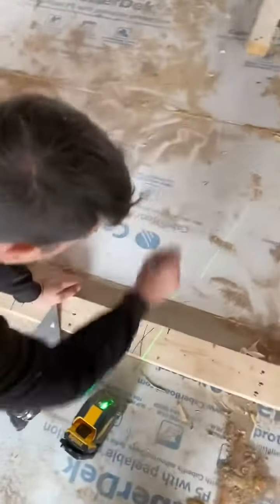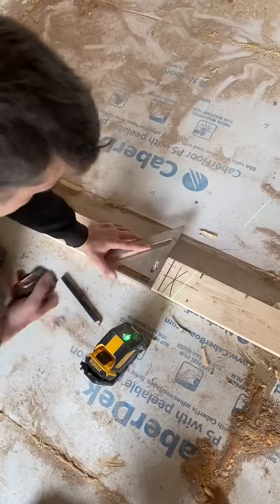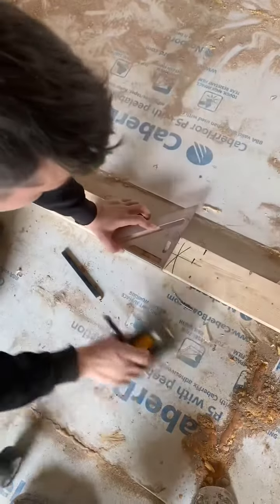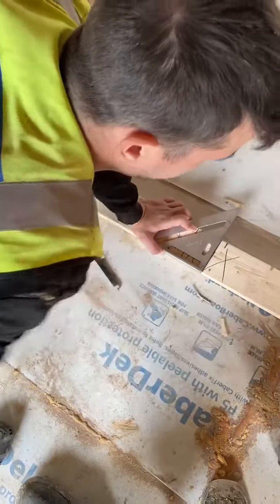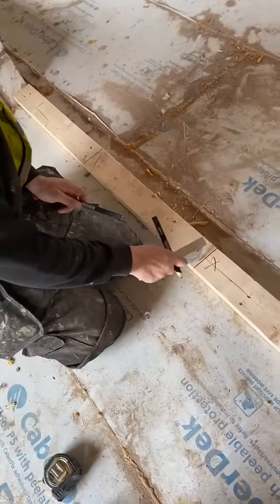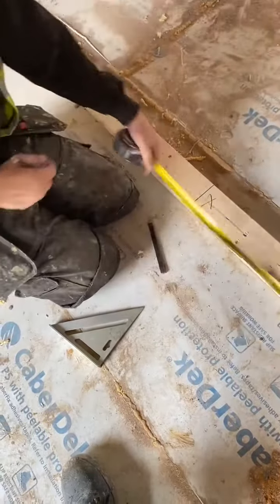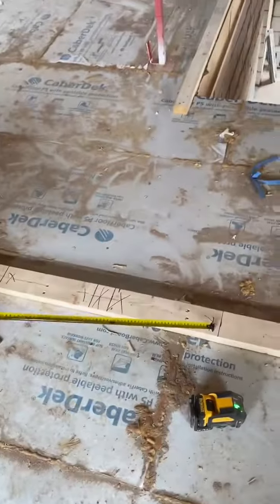That intersecting wall there means you'll have a stud here that will be open for that wall, with a spacer in between. Then it comes to about 63mm — that's from a CLS — and there will be another stud there. That is the door opening, so that stud needs to be cut off. That's how you lay out. If the wall is bigger, just continue at 600mm again. But you don't need to here, because this wall is less than 2.4m, so the next board from this one will fall before the end of the wall.